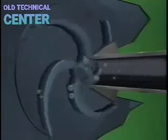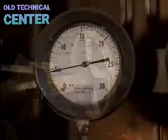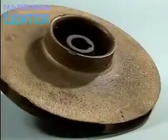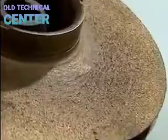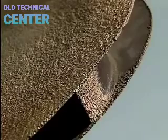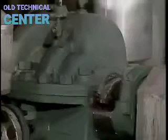Cavitation can occur if the suction valve is not fully open or if the suction port is blocked, further reducing pressure at the suction eye. When cavitation is severe, the pump should be shut down — the constant force of collapsing bubbles can eventually disintegrate the metal vanes and inside surface of the casing. Other signs of cavitation include rapid fluctuations in suction pressure and overheating of the pump casing.